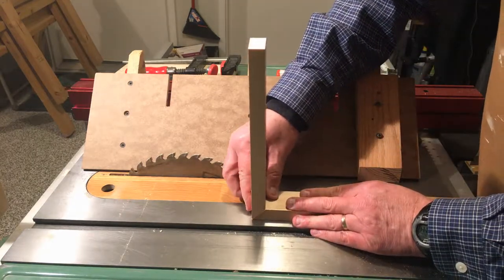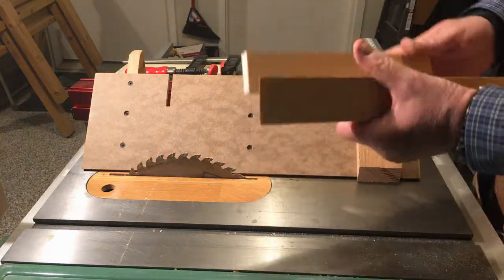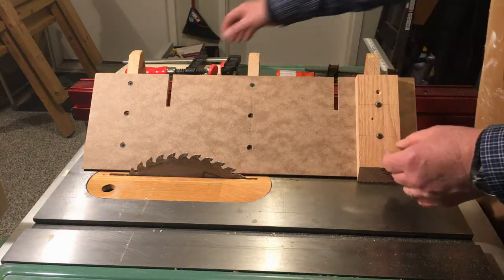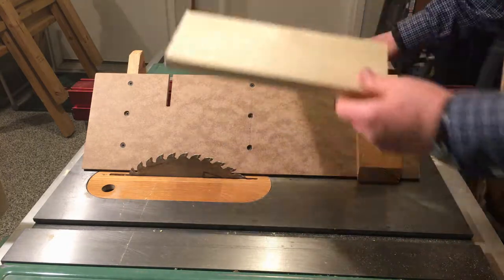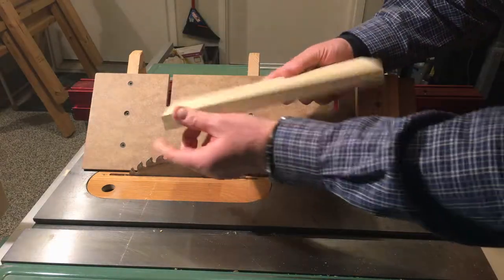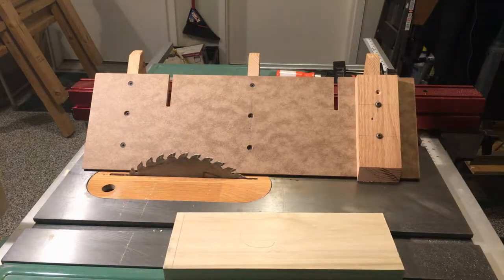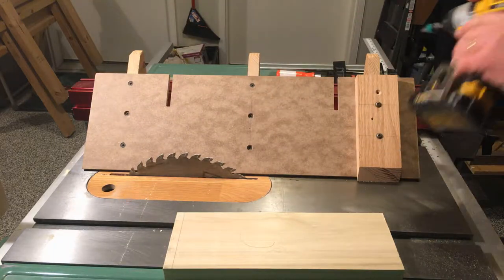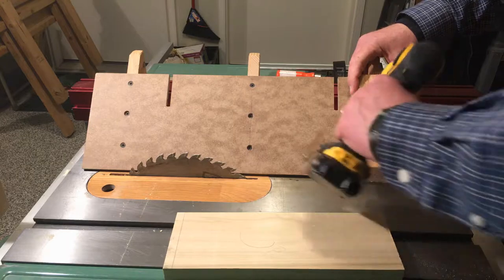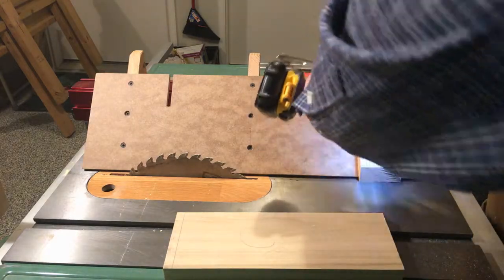Two perfect 45s, as you know from your shop math, make a beautiful 90-degree edge. That's lovely. For the next cut, we're going to cut a bevel along the long edge of our workpiece. I'm going to remove the hardwood fence because in reality you might have a much longer piece — so let's get rid of it. It's just screwed into the one buttress.